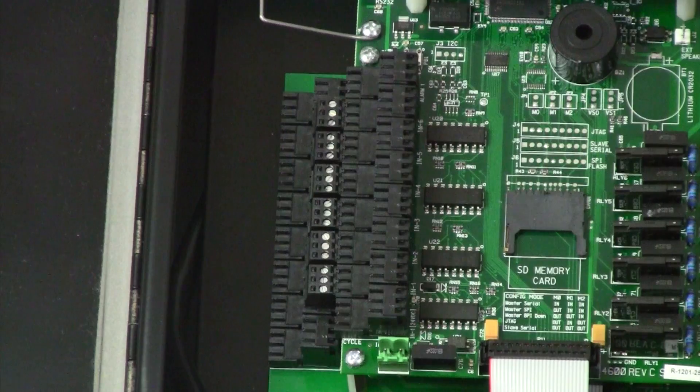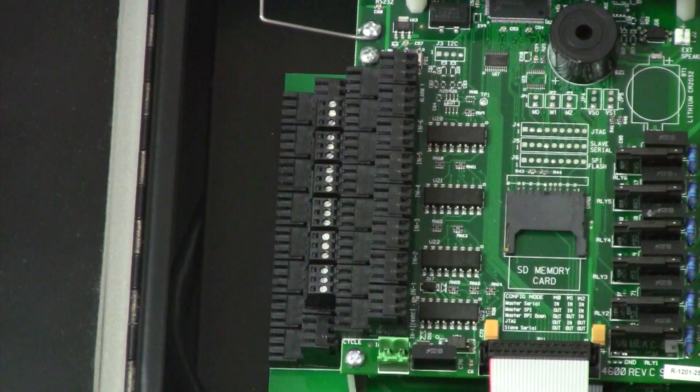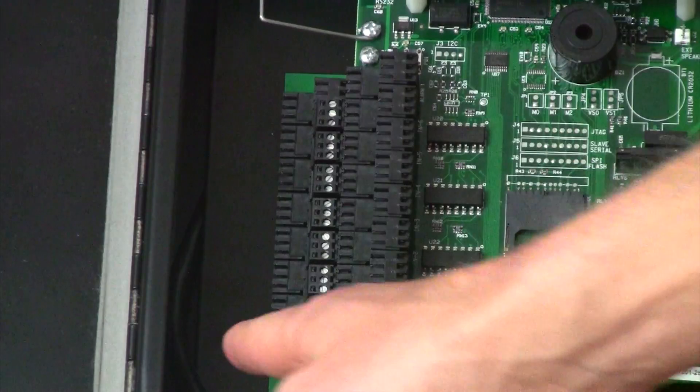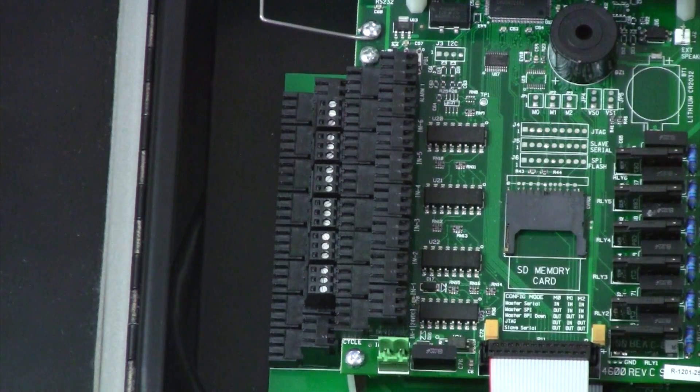The location for the input from a flow sensor to this SPR2000 circuit board is located on the lower tier of the two-tier connectors on the circuit board. There are six input connections for flow sensors on the main board, and on the expansion board there are an additional eight input locations also on the lower edge of the multi-tiered connector. It's important to remember that the flow sensor correlates to the correct output — so if you're wiring up your flow sensor for output number one, it needs to be plugged into flow sensor input number one.